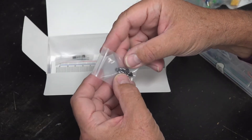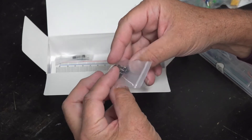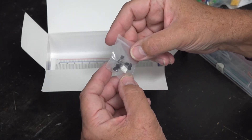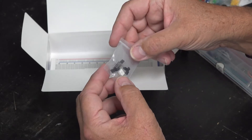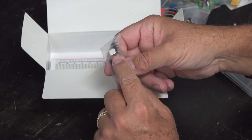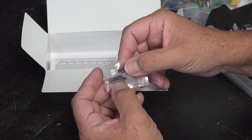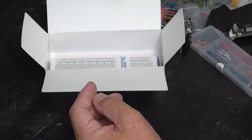We have 10 little push buttons — these are single pole double throw push buttons. And some various electronic devices: we've got four 2N2222 NPN transistors, this little white 6-pin dual inline package is an optical isolator, and this 16-pin dual inline package is an 8-bit shift register. Not too sure what we're going to use those for, but they're nice to have.